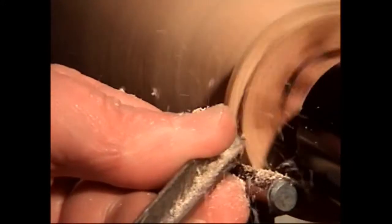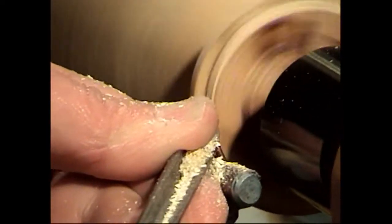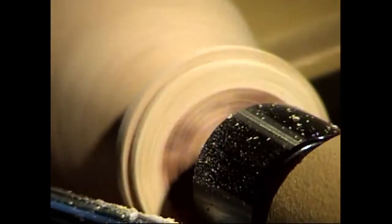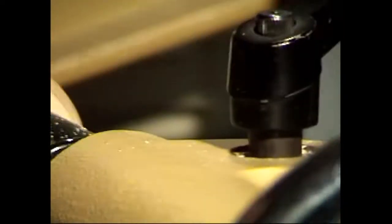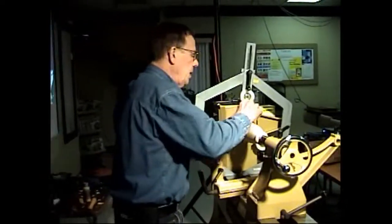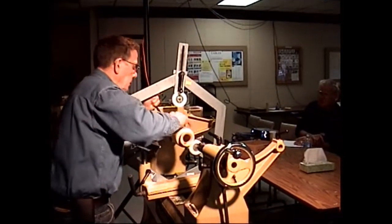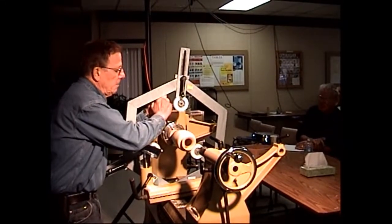And I'm going to take a little more off the back here if I can. That should be enough. And we're going to find the right tool here, maybe. Here it is. And we're going to recut our dovetail. Okay, so we have an accurate dovetail place to grip now that is as true as possible with this bottom part of this vessel. So we're going to just lock him in there. We're still not touching the bottom there.